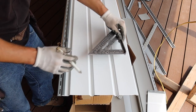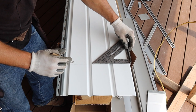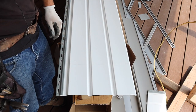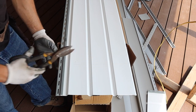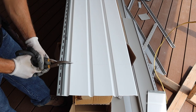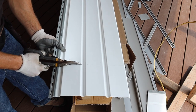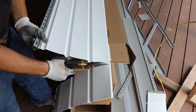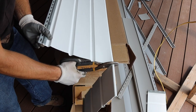To cut the soffit it's pretty simple — similar to vinyl siding. Our measurement here is 137 and three-quarters inches. Pull the tape, make a mark, then take your speed square and go off the straight edge of the soffit to make a straight line over the mark. You have to go off each edge since the speed square isn't long enough. Then take tin snips and cut straight down that line — it cuts very easily, especially in warm weather.